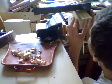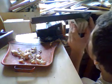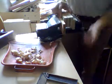It's time to get a square. We have roughly removed enough and come to the level where it's time to start checking. We hold it against the light from the window, and then we start looking. If it's more or less square, we're very close to square. When you plane a lot, you develop a kind of feeling for what is square and what is not.